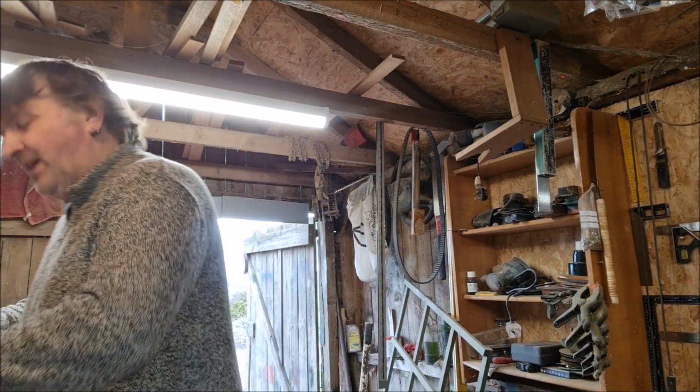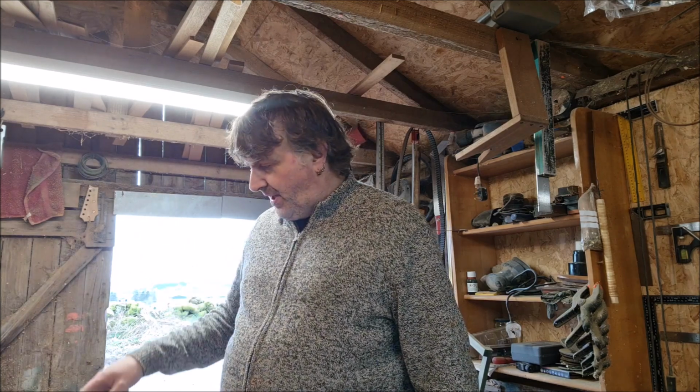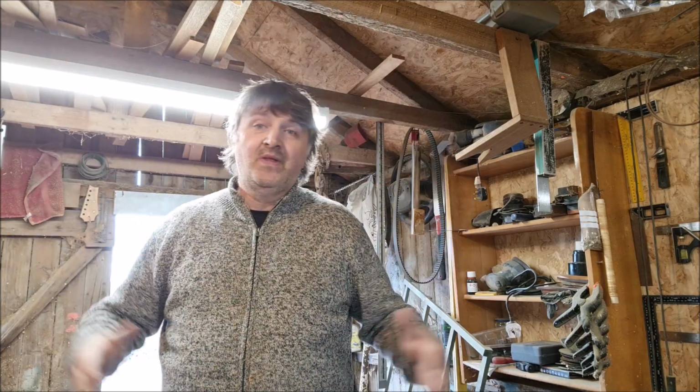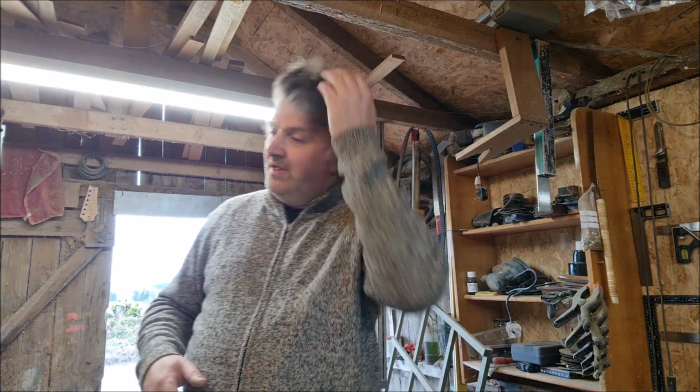Bit of effort, but my planer bed, the actual planer section, is about 314 mil or something like that. But there's a casting at the edges of the cartridge that you can fit just over 330 mils through. I think 335 or something like that maybe. So I can fit it with the bit of melamine board in place on the bed. It means I can fit wider pieces through, but then I still have to hand plane the little edges at the sides. It doesn't get them obviously.